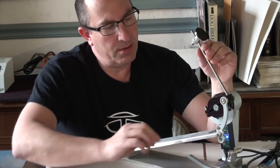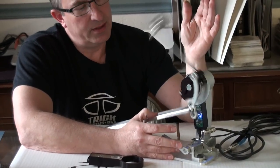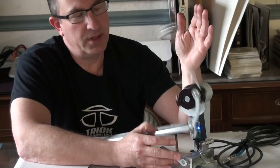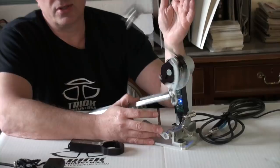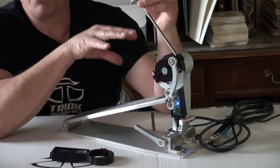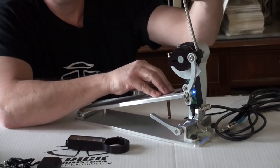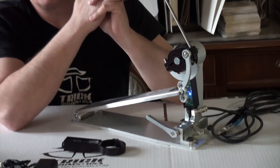What the computer is doing, once the pedal starts moving, is sensing that there's motion and interpreting the velocity. And basically what it's going to determine is that when that velocity abruptly stops — which would mean you're hitting your bass drum head — it triggers. It's basically the world's fanciest switch, but it doesn't come with all the other issues that you have with a piezo style trigger.